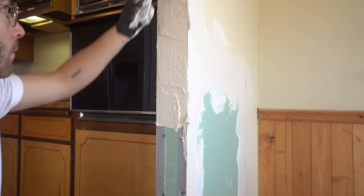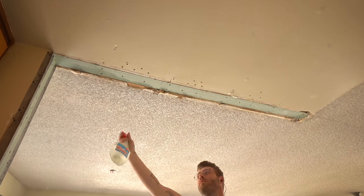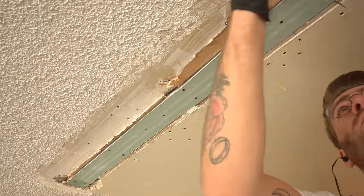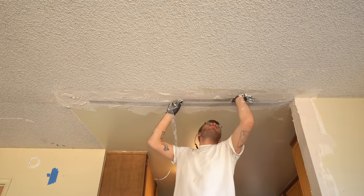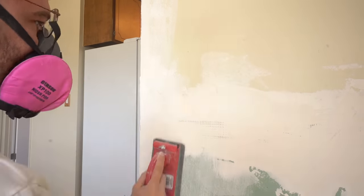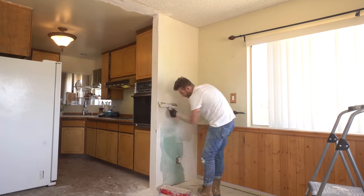In this shot you can see how I should have mixed my joint compound up a little bit more, but that's okay — we'll sand and backfill everything. Before I could address the ceiling, I needed to remove some of this popcorn texture, so I added water and a couple of drops of dish soap into a spray bottle, and I used that to soak it before scraping it with a putty knife. The steps on the ceiling are the same as the wall — I wanted to make sure I got plenty of joint compound in all of those cracks before I applied tape, and then I smoothed everything out. Instead of using sandpaper, I like using sanding nets whenever I'm sanding down drywall and joint compound — it does a great job of not getting clogged and lasting a long time. After taking down all of the high points with 150 grit, I then applied my first full skim coat onto the wall, making sure that the surface was level across the old and the new drywall.